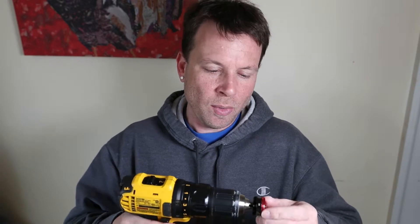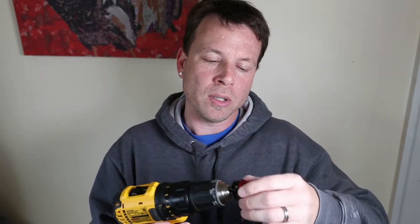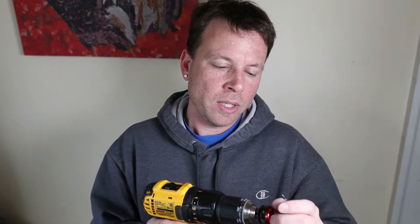At 2300 kV we should get roughly one volt out of it. So what we're going to do is take our drill, put the motor shaft into the drill, tighten down on the motor — just don't really crank down on it because all we want to do is hold it there. Then we set this to the fastest speed the drill will go, and clockwise we hold the back of the motor and give it full bore. We're going to test that with the multimeter.